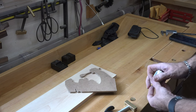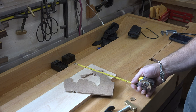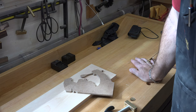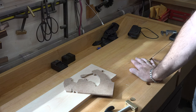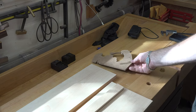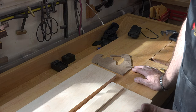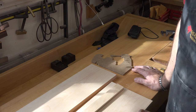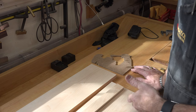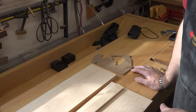So I'm going to cut the 7-inch wide, 3/8 thick maple into usable pieces. In this particular case, for this pattern, I only need 8.5 inches. So I'm going to cut this into 8.5 squares, put the rest back on the rack, and then trace out the pattern onto my stock and cut them at the scroll saw. You guys don't need another video of that. You saw me cut the actual template itself, so there's no need to see it again. So I'll see you when I get those two pieces cut.